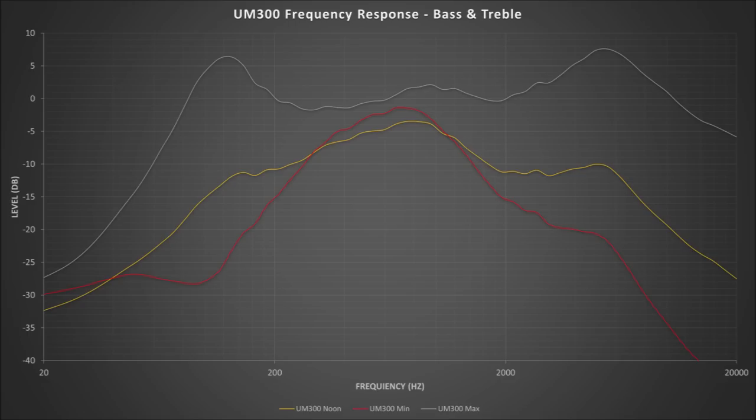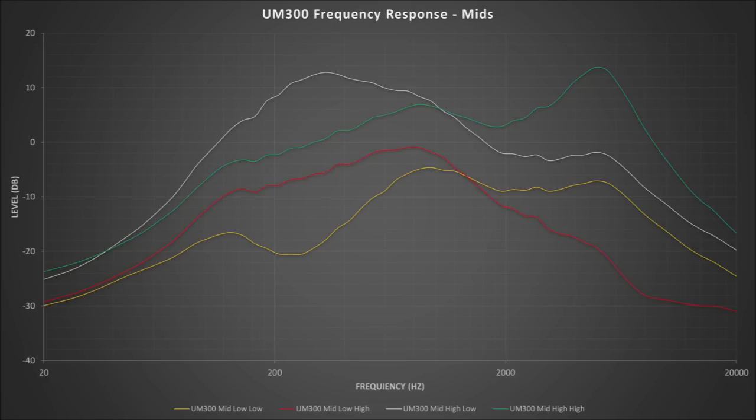These are, again, hi-fi-like controls that you wouldn't see in an amplifier's tone stack. They don't work that way, which is why I would still recommend using both of these pedals in front of a clean preamp. That way you get more fine tuning available to you. The middle controls are a bit of a different beast, since you can actually sweep the mid frequency from 200 to 5,000 hertz. So closer to the middle, you'll get kind of a Mesa Boogie Mark series effect.